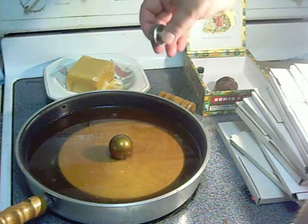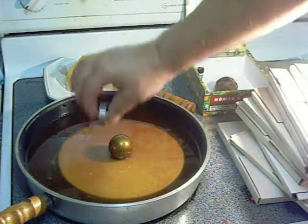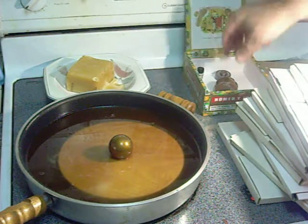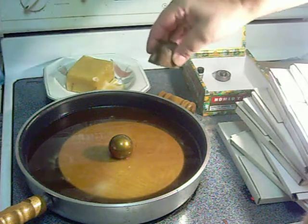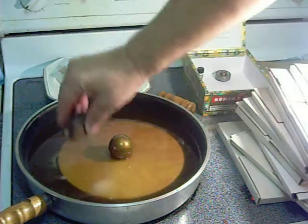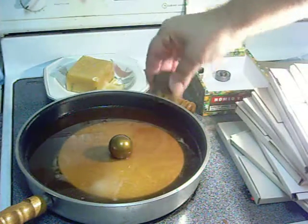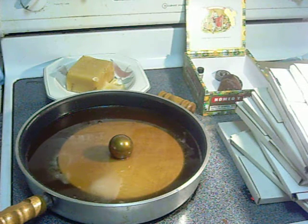When I know that I've done that really well — you can put a vice grip on there and it makes a nice handle, but with my big paws I can get away with it — I put the actual lap in the faceting machine and put some olive oil on there as a lubricant. I have this polished surface with a nice chamfer around it so there's no edge to catch, and with the machine running I run this in with some olive oil, and once I feel it's really impregnated nicely and smooth the way I like it, it's ready for use in the faceting machine for polishing your facets.